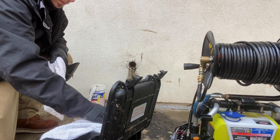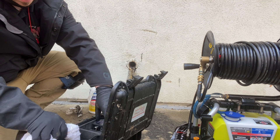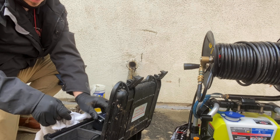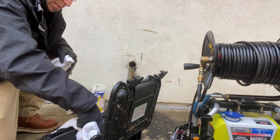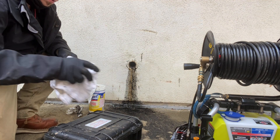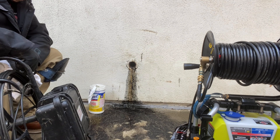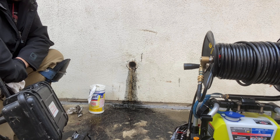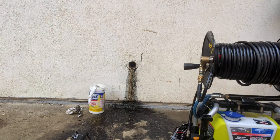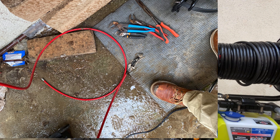The push rod on the Vivor camera is so rigid that if you get the line draining with this little pressure washer, you could probably push the wipes and toilet paper all the way out to the city main with the rigidness of this camera — I just did it on this job here and it worked really well. I know other guys who do the same thing with even more expensive cameras. This camera being inexpensive means you can kind of beat it up a little bit and it takes it well. Having this camera has completely changed everything for me as far as drain cleaning and unclogging goes. And I know I promised you guys a picture of the recovered flex shaft — here we go, there it is.